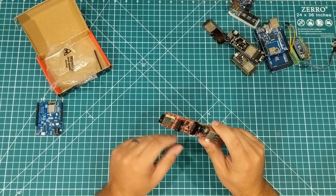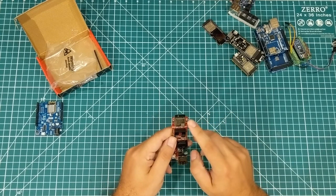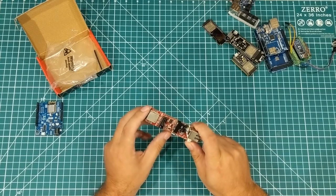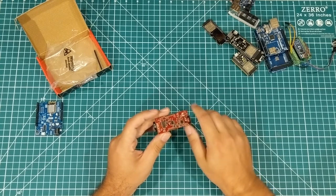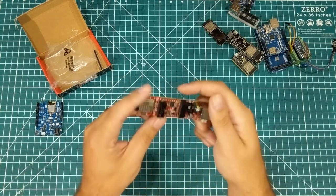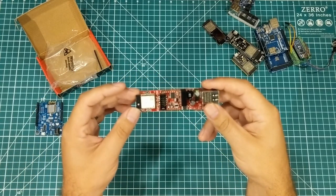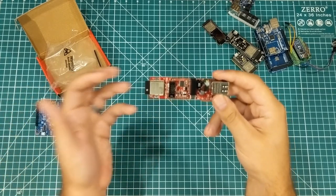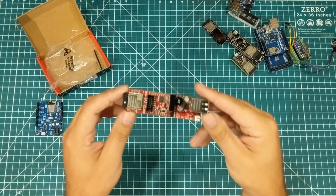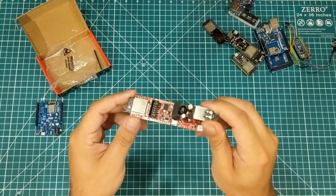Let me give you the quick rundown: they have this ESP32 chip and you can program it with USB. There's a couple of buttons — a reset button and a user button that can be used inside your sketches. It has the ESP32 and it has an SD card slot on the bottom. There's a lot of stuff packed into this little board. You get 160 megahertz, 16 megs of flash, and 512K of RAM all packed in here.